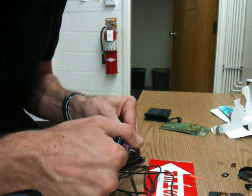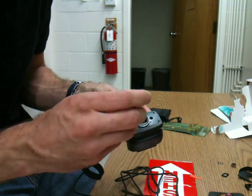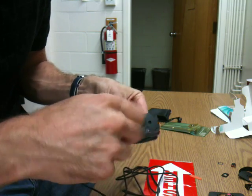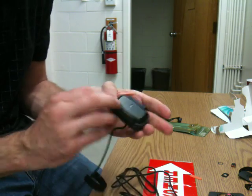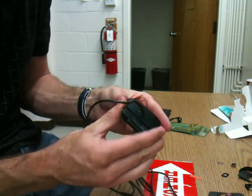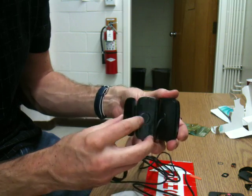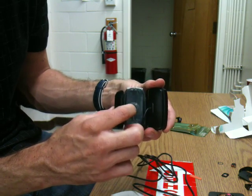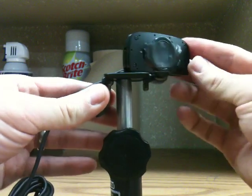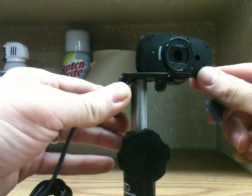It's still pretty easy to keep dust off the sensor — when I'm not using it, I can just put a piece of scotch tape over the place where that cover glass was. I've now got this packaged up nicely, just like it originally was. If I want to mount this in a traditional optics mount, the easiest way is probably to drill a number eight through hole in the top of the mount, screw that into a standard post, put it in a post holder, and swivel it as necessary.